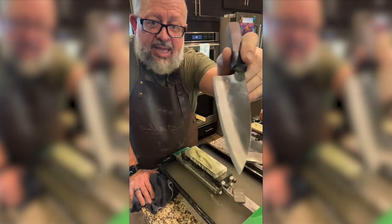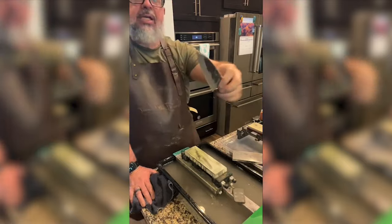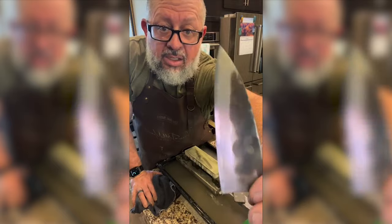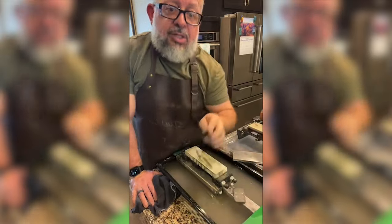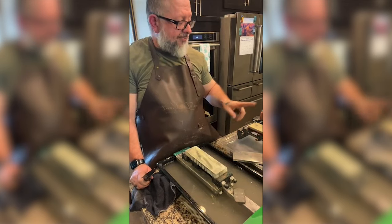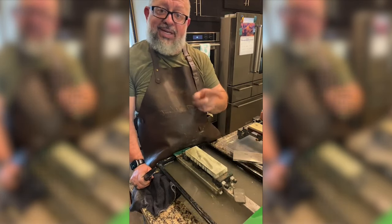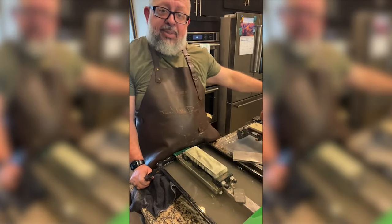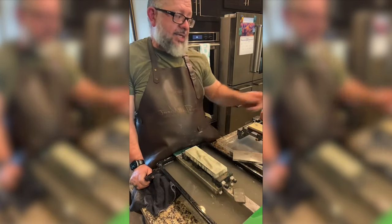So that is the side that's unpolished. That's how it came. We are learning polishing today. This is where we're at on our side. I have never polished a knife before, ever. I'm not kidding. So we did a 200 grit Nano Hone, a 300 grit King, a 400 Naniwa Professional stone. We did a 1000 Naniwa, but we didn't jump to the 1000. We made a mistake and we jumped up to a 2000 red Aoto, Japanese synthetic stone. Then we went to the Azuki, so that's like a 2,000 or 4,000.